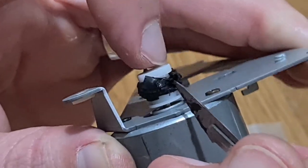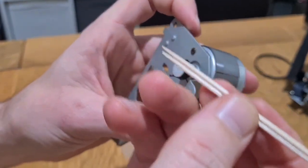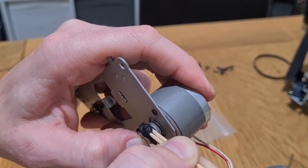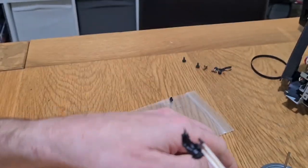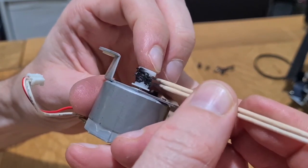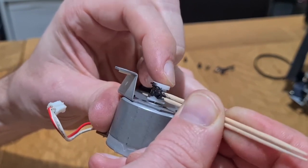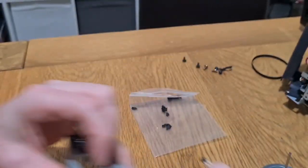As you can see, this belt has wrapped about eight times around this pulley. I really don't want to start messing about taking the pulley off and potentially damaging it, so I'm doing it in situ. I'll put a slice down the belt and try to peel it off. The trouble is this stuff gets everywhere — if you get it on your hands, gloves make it worse. I'm using two cocktail sticks because the pulley on this motor is thicker in the middle than on the outsides. Just keep chipping away — this cleaning took about 15 minutes.